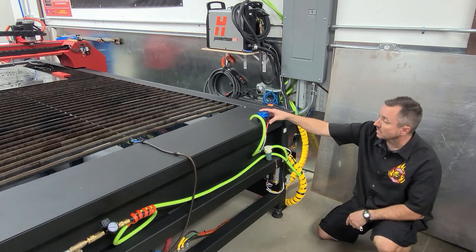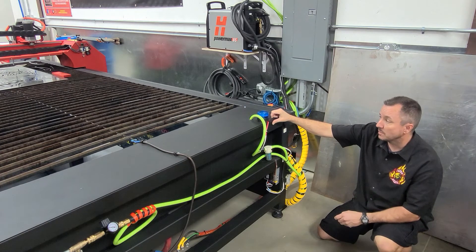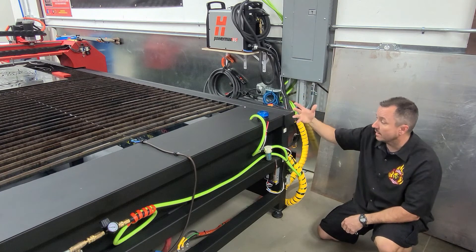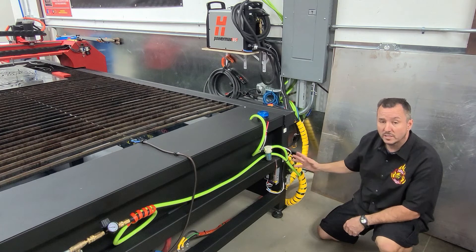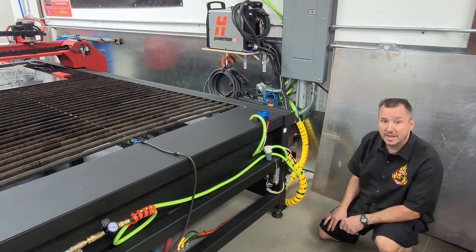This light up here flashes when I turn the pump on, letting me know the pump is running so I can see it from the other end and remember to turn it off. It's a pressure-demand pump, so once it reaches pressure it doesn't run continuously. Even if I forgot to turn it off, it's not going to hurt the pump or burn out because it's the demand style.